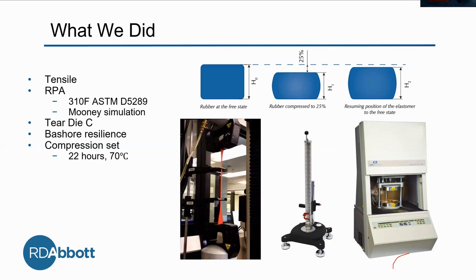It's important to see how the rubber is going to act after it's squeezed between two parts. Here is the original rubber piece with no stress on it yet. Here it is compressed — we put it in, squeeze it, and heat it up. As you can see, it's nowhere near that line. And here it is after we take it out and it recovers — it doesn't quite hit the line it was at before. There's just a difference, and we need to know these things.